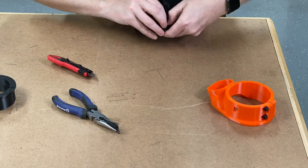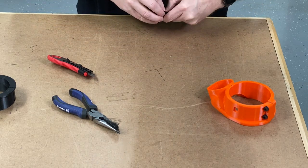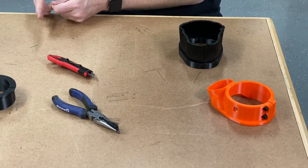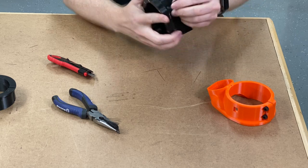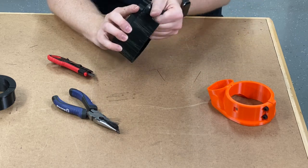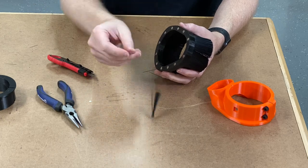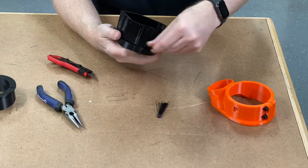I can look in from this angle and it looks like I need to trim mine — about two or three millimeters. I'm going to chop off about two or three millimeters right there, working my knife right in between there. Because remember, once that knife releases it's going to go right into the surface of that brush track. I can use pliers on there to gently trim those off until the brush can fit into the track. I cut these brushes by hand — I set it up on something, measure it out, and take some snips. So they're not laser cut or anything; you do need to maybe chop off a couple millimeters to get the boot fitting correctly.